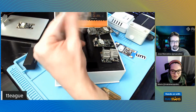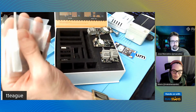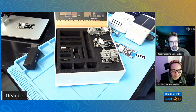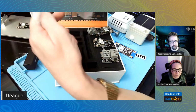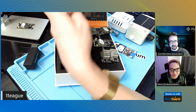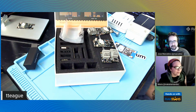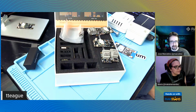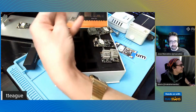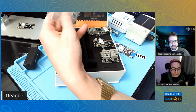And so each kit comes with 5 different sensors. And what all do we have here? We have an environmental sensor, which will give you temperature. It gives me humidity, barometric pressure, and also an air quality index, a volatile compounds index in the air. So this is like smells, bad smells, and some methane, kind of alcohol as well. It detects alcohol. You can actually make an alcohol sensor using that as well. You see the spike if you approach it with some vodka, for example. Right. And that's using the Bosch sensor. That's right. The BME 680. Yeah. Right.